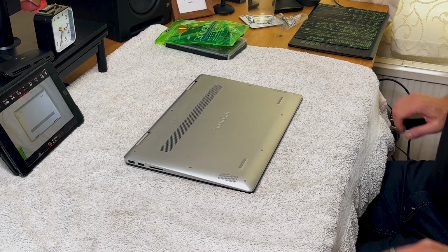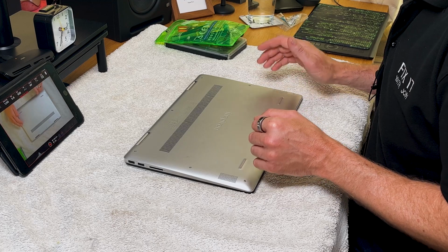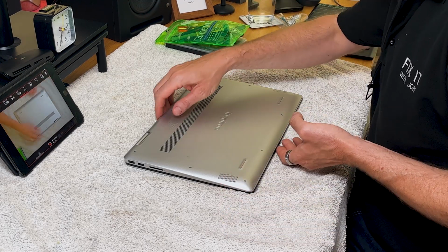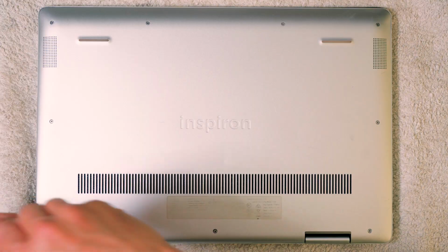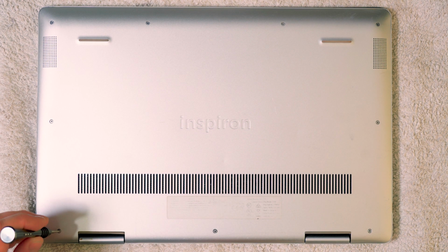Okay, so we're going to go ahead and have a look at this Dell Inspiron, which has a faulty DC power port. When the power's coming in, it just hasn't got much of a connection on it, honestly. So this process will cover that. You're going to need a 1.5mm Phillips screwdriver. This is a typical one you get in mobile phone repair kits, but I'll put a link in the description to this particular screwdriver.